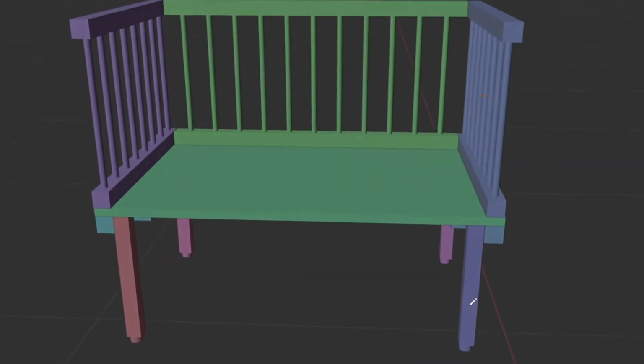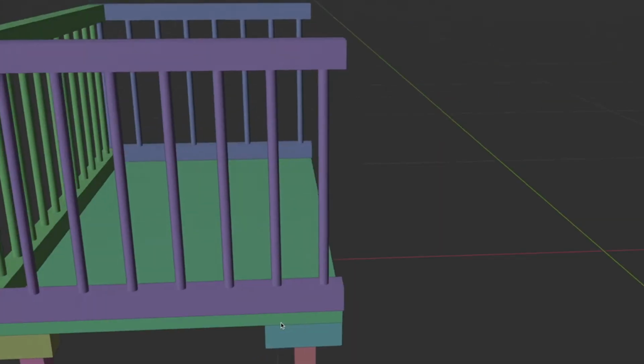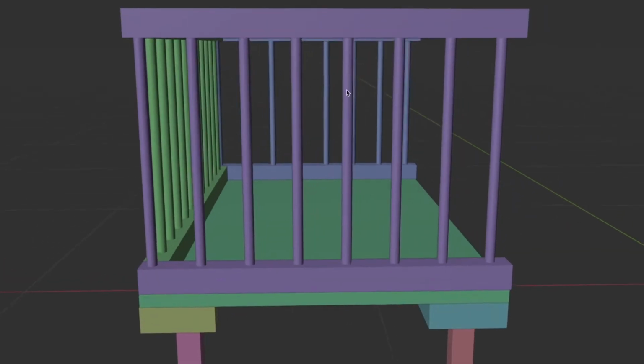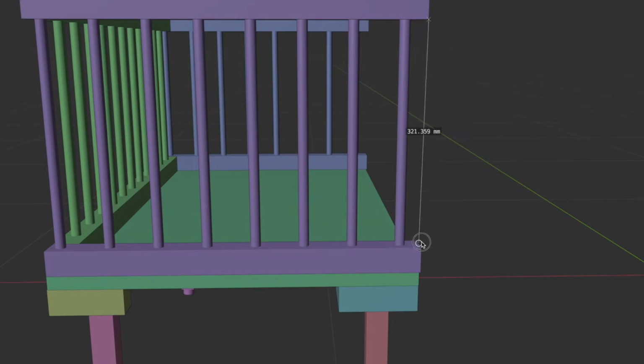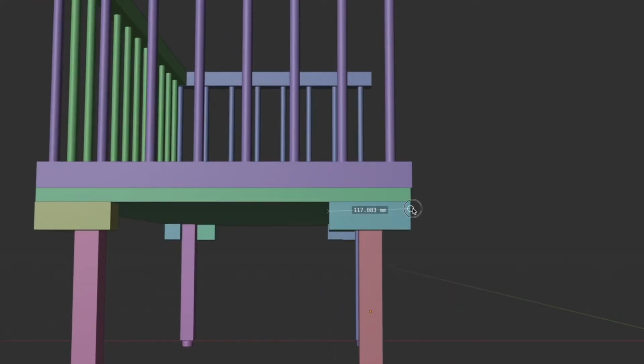Now I'll show you the measurements from the design, which keep in mind might be different for what you need. The mattress is 50 by 80 centimeters. If we add both rails from the side, it should add up to 88 centimeters, and from the back 54 centimeters. The bars are going to be 1 meter divided by 3, so around 33 centimeters, minus what is going to be inserted on each rail. The L bracket should be between 10 and 12 centimeters, and the legs around 30.